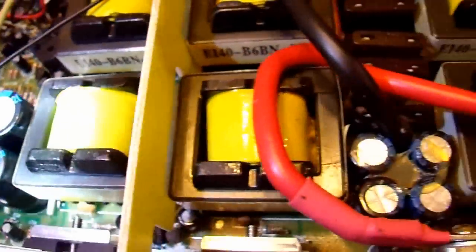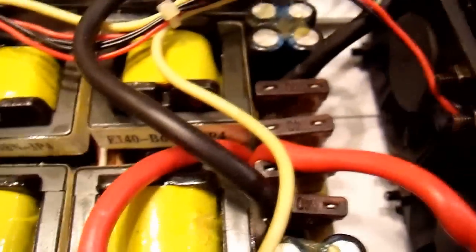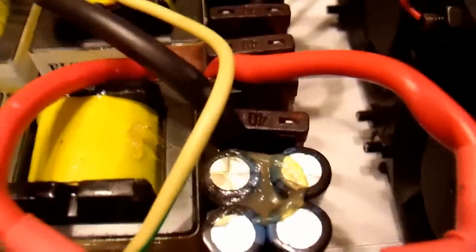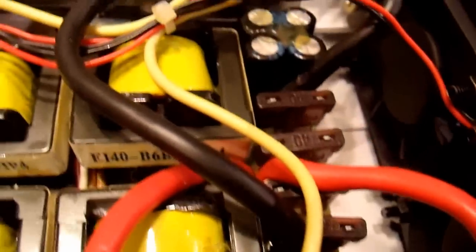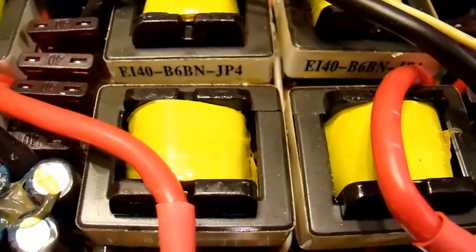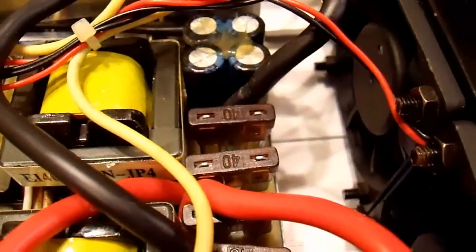There's not enough capacitance in here in terms of bulk input capacitance. We have a set of four here, set of four here, four here, four here — I think they're 2200 microfarad each. But in any case, they're 16-volt capacitors, which is not adequate for a 12-volt system, and there's not enough of them. So you're relying on the battery to handle all of that ripple current. That means all the ripple current has to go through the input cable, and your battery gets stressed because the plates see physical stress when there's ripple current — they vibrate, and you can probably hear your battery hum when this is running.